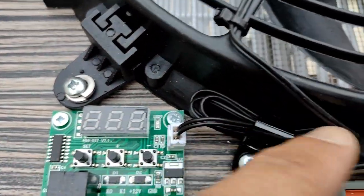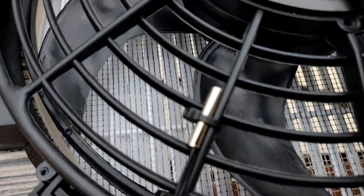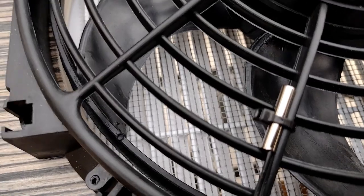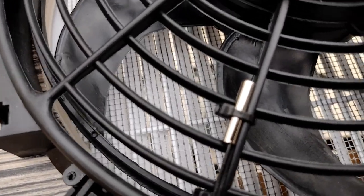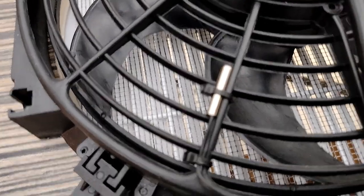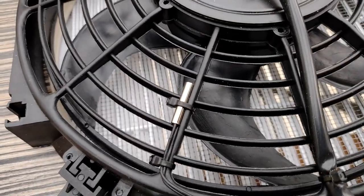There's a tuning knob on the speed controller. The thermostatic relay has got a thermostat and I put it in the line of the fan, because I want to set it to the inside van air temperature. So if we set it to say 25 degrees, that's the air temperature, and when the fan cuts in, it'll run.